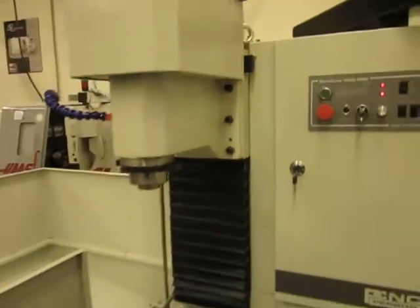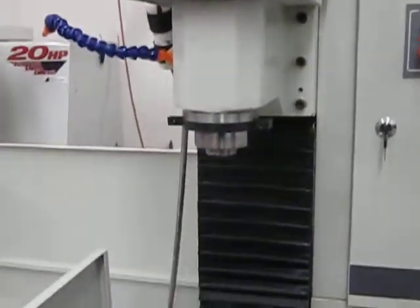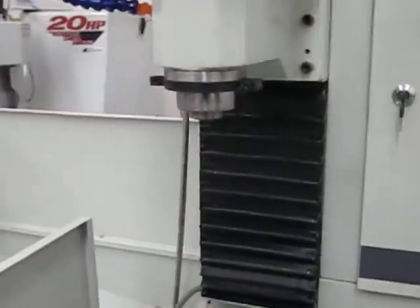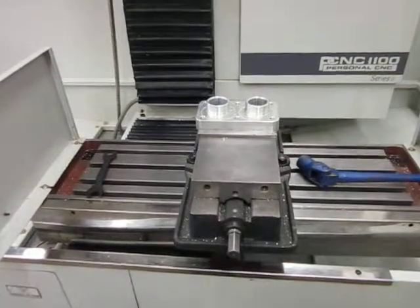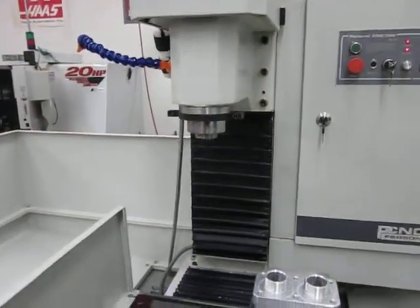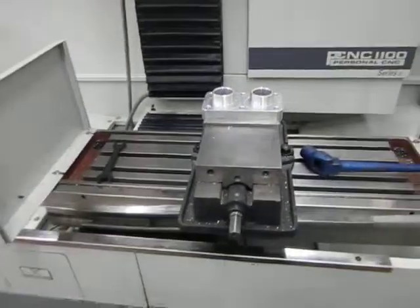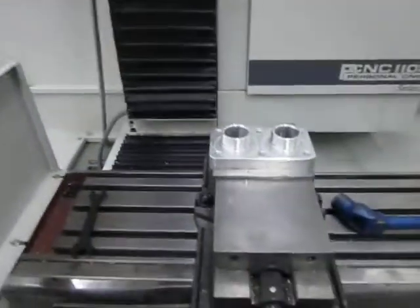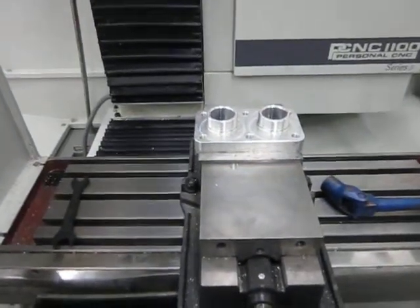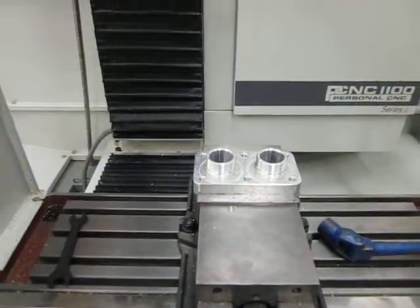You won't be able to see the Y or the X, but they're done. So when everything's in relationship to the spindle — if I want the table to move left, I need the spindle to go X positive to move away from my limit switches. And if I want my table to move toward the base, I need it to go Y negative.